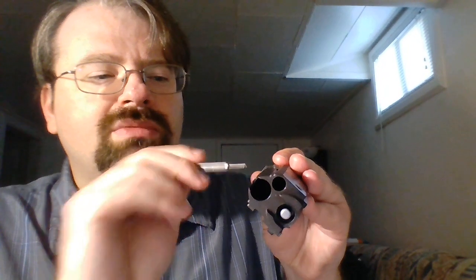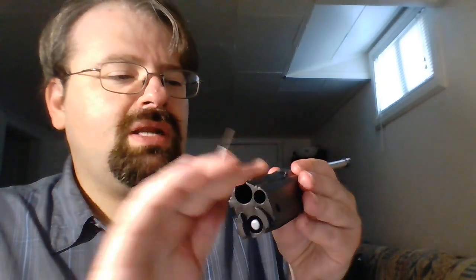Most AKs make this part considerably thicker, especially on the tail end — more gradual cuts, a little bigger, bulkier — but that gives them very nice longevity. AKs can last multiple decades, basically just repressing in barrels from time to time. Bolt carriers on true military-spec AKs typically last a very long time. This, on the other hand, is too thin to be a real longevity piece. Everything I'm seeing here is basically what you'd expect in a commercial-grade gun — this is not designed to last a long time in hard service.